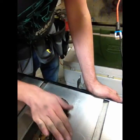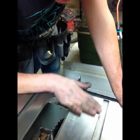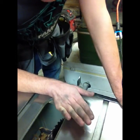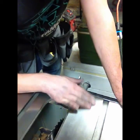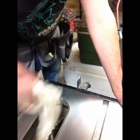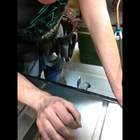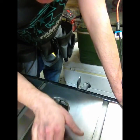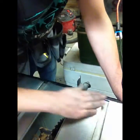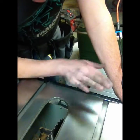There are some machine marks left over — I don't know if you can see them with the glare, but that's nothing to be worried about. You get it as smooth as you want, but you don't have to worry if some machine marks remain. Just as long as it buffs out nice and that wax layers really well so you get rid of all the rust. Now if you have some pitting in the top of your table saw you're going to have to do a little bit more work to get that pitting out. But the point of this is to get rid of the rust and make your table saw real nice and smooth so work slides right over it.